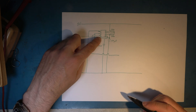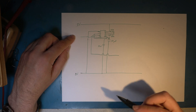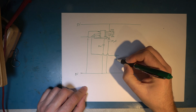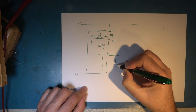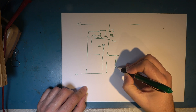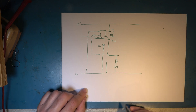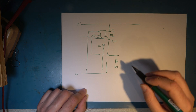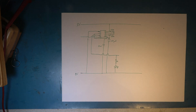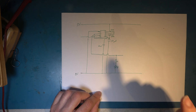This pin 4 connection will be controlled by a switch at the front. From the output I could connect an LED here — modern LEDs don't take much current, so a 1K resistor gives just a few milliamps, which is enough for a modern high-performance LED, and that way I don't get big spikes in the power supply. This is the output that I want to operate the record switch.